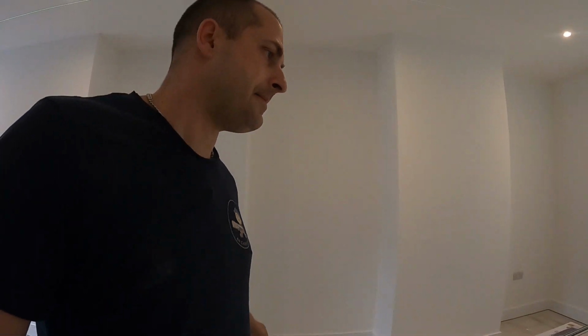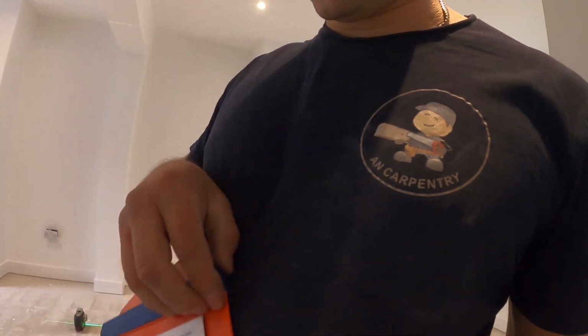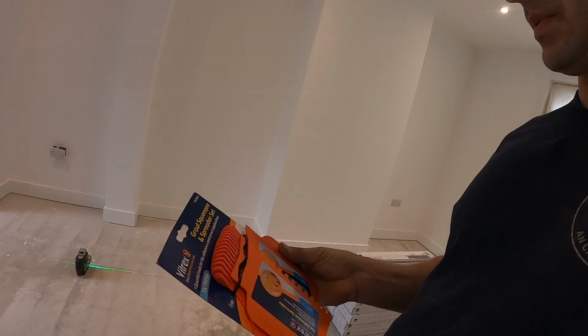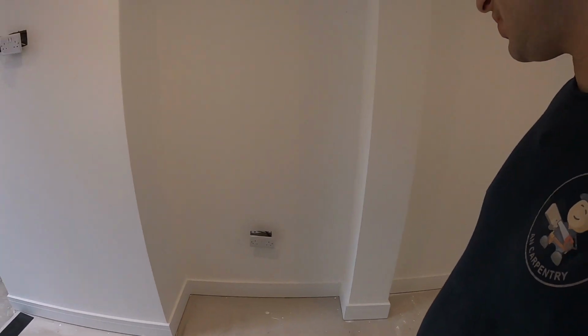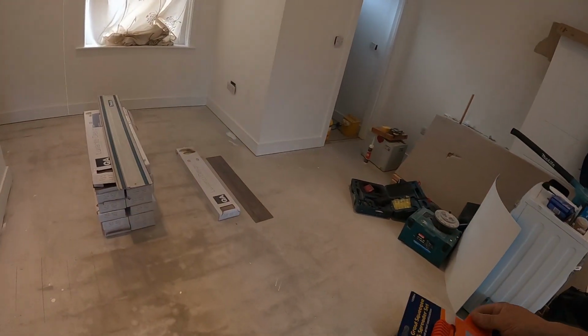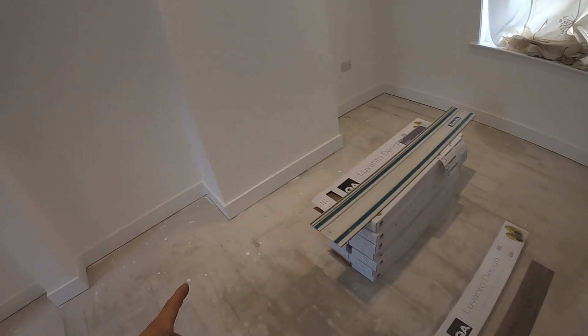So yeah, as I said, you can use a chalk line to pin the line, measure depending on which way you're going to have it, measure the width and then calculate where it falls in. That's why I have bought a set of notch trowels, spreaders, so I'll use probably that, it was what they advised. Put the adhesive down. I'll put just in that area first, and then I'll move my way. I'll be going this way into the room.